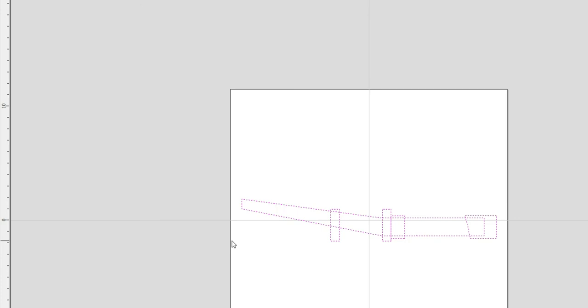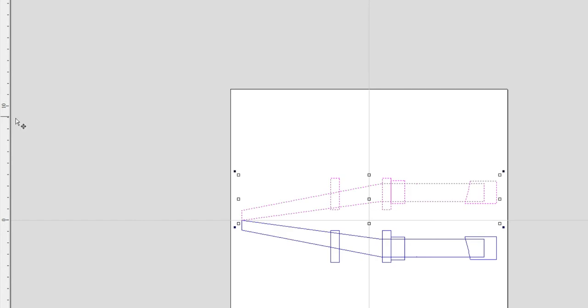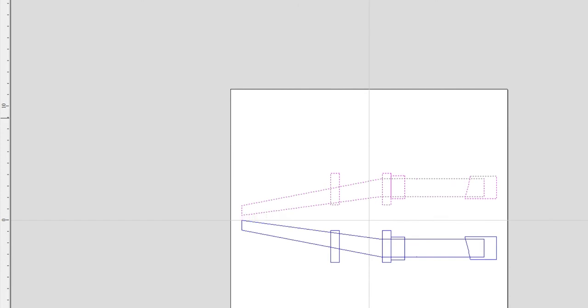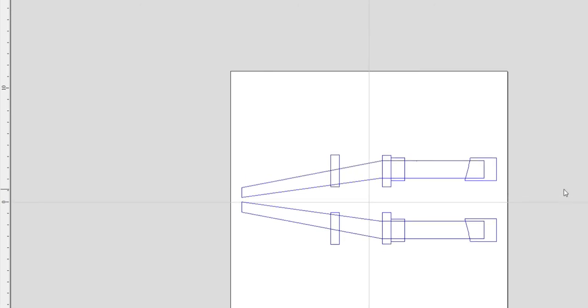Now, I'm going to flip this so I get a left and a right. You're going to have to do that with also the front rails. The front rails are pretty much the same thing once you get them set up. The lower two dados, that'll be coming up in a second. I cut those at 4/10. The other ones, I cut at 2/10. And that seemed to work out well. I was just very, very happy how that turned out.